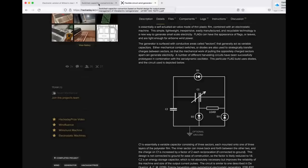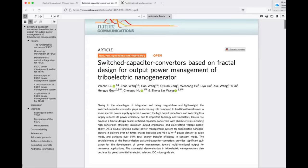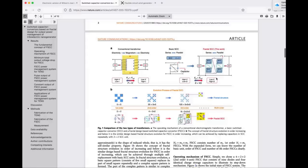We want to know about switch capacitor conversion — in particular fractal switch capacitor conversion. This paper is absolutely awesome. Going through it we get a good idea of what this actually is and how it works. This is a standard AC transformer, and here we can see the basic switch capacitor converter, where we're switching capacitors between parallel and series — connecting them in series to charge them at high voltage and low current, then reconnecting them in parallel to discharge at low voltage but high current. According to this research paper, the fractal design mitigates against those losses. Suddenly, everything becomes exciting.